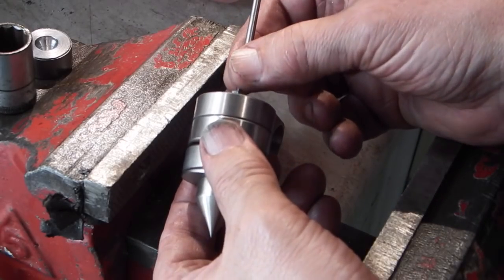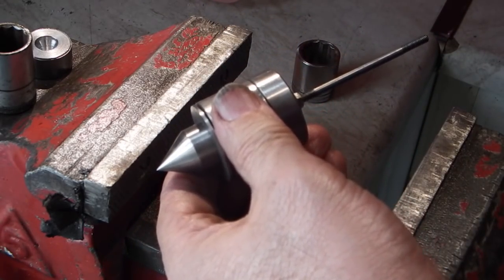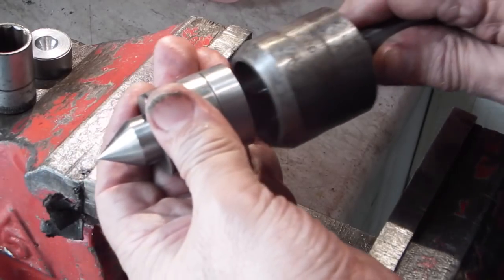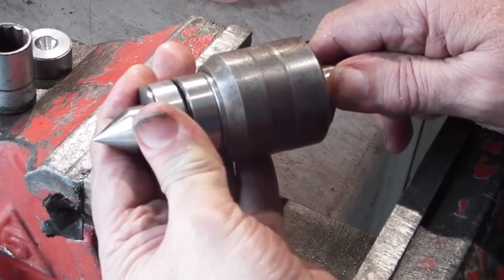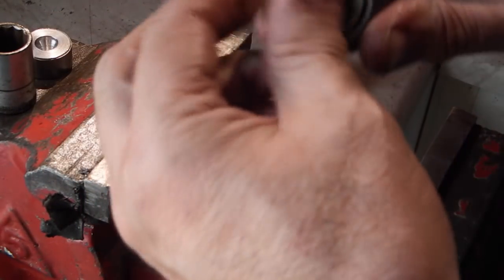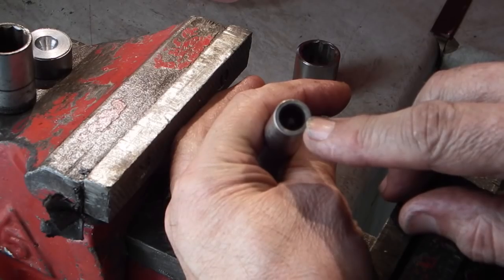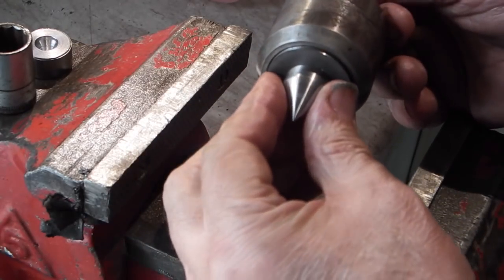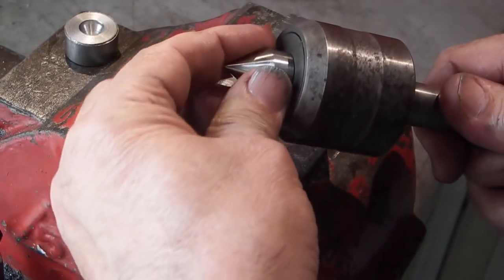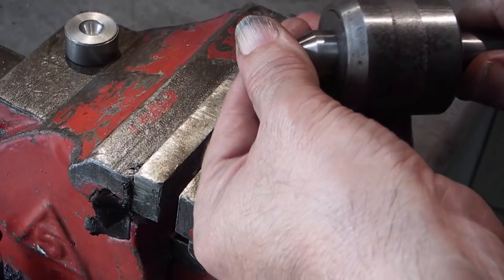I've put the small shaft in the back with a nut and a washer - tighten that up. Now the bearings should just slide on into this housing. That just slides level. Then in the back here we just put another washer and a nut. As we tighten this up it will pull this back in, pushing the end cap. There's the refurbished centre. I didn't need to change the grease - there was enough grease inside and it was clean.